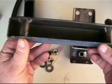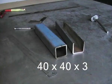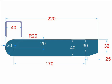The construction of the suspension arms is quite simple and straightforward. Basically, it's just a piece of channel with two axle sleeves welded in place. The channel sections are cut from a 40x40x3mm square tube to a length of 220mm with one face cut away. When you've cut your channels, the first thing to do is to mark your drilling points on each face — the first one being 20mm from one end and another 170mm from that point, but set 30mm in from the back of the channel.